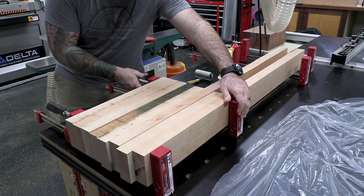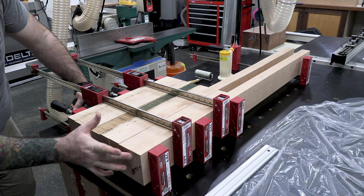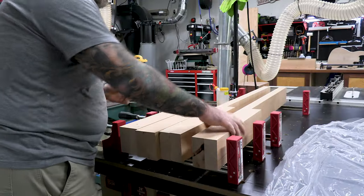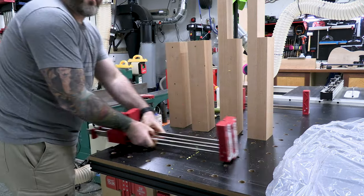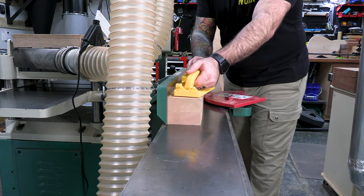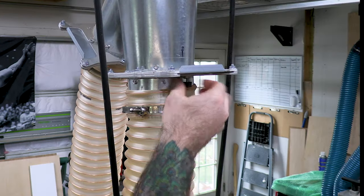To save clamps, I glued everything up all in one go. The two pieces with a double section at the bottom and a thinner single section at the top will be the headboard legs, and the smaller ones will be flush with the actual stretchers. After the initial glue-up, I did a secondary milling pass — starting at the jointer to get two faces square, then over to the planer to bring everything to final thickness.